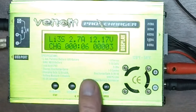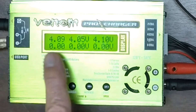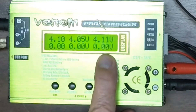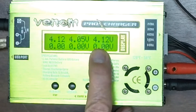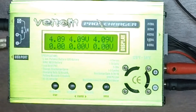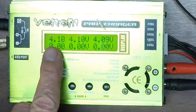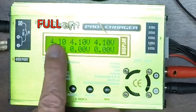While that's going, it's actually charging my battery. If I hit this button right here, I can see cell number one, cell number two, cell number three — and if I had six cells, those would show down here. This is partially charged because if it were really discharged, there would be three-point-something on each cell. Normally, I'd go get something else done, and I would either hear this thing beeping at me, or when I came back it would say 'finish.' That little indicator tells me it's done.